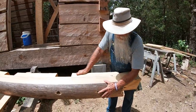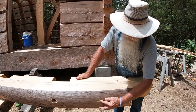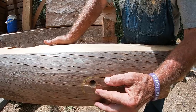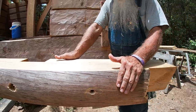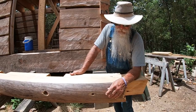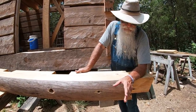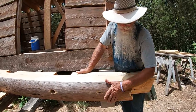There's something that I was going to show you. I did this on round 8, but I didn't get it filmed. You can see a hole right here where I drill through. I'm going to put a 1/2-inch threaded rod through this down below round 8 on A and C wall. And that rod will go all the way through the top plate. So I'll actually be bolting or tying those top 4 rounds together to keep it anchored on the wall really good.